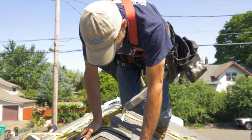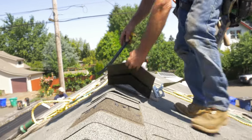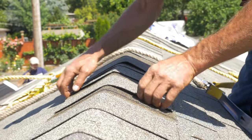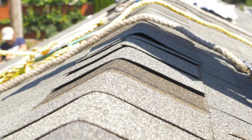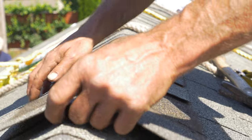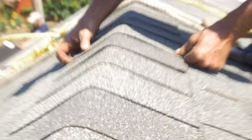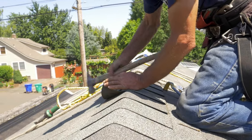We can take our removed shingles and replace them. Be very careful — just lift up gently and tuck the first shingle back in place. With our shingles in position, we are ready to re-nail them. It's best to do this on a warm day.